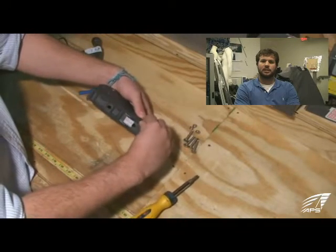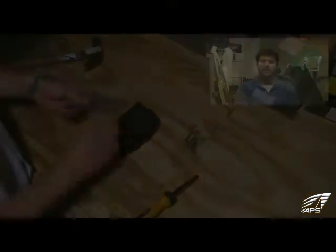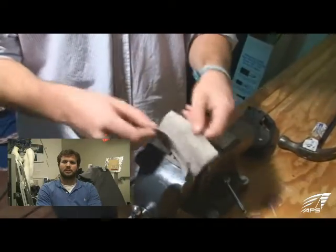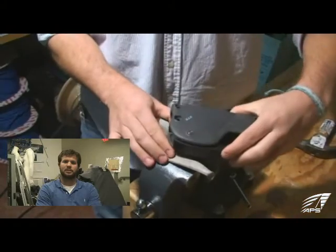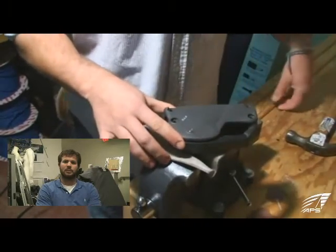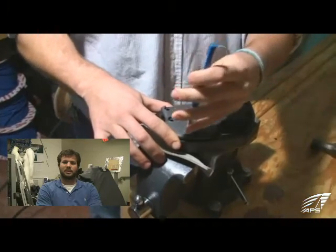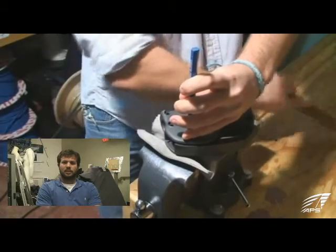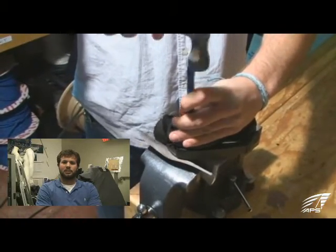The last bit that's going to come out is a pin that's pushed in there that the handle rotates on. So we took it over to our vise. Got a piece of leather there just to protect the cleat when we hammer it out — also helps catch the pin if it goes all the way through. I've got a punch there; you can use any sort of thing just to help tap it out. Just got a hammer and tap it right on through.